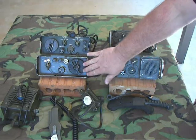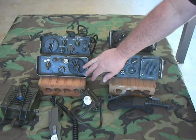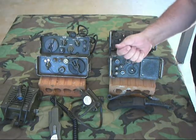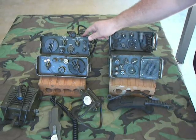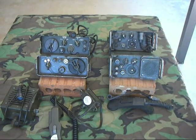The remote unit right here actually had a 45-volt battery in it, and that's how it keyed the radio at the other end. When they would set it to radio — the radio function switch right there — and key the handset, it would then trigger a relay in here with the 45-volt switch, which would key the radio. Then they could talk, and everything would go, and they'd release it, and everything would go back to normal.